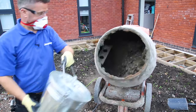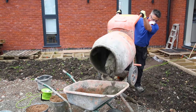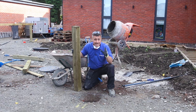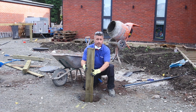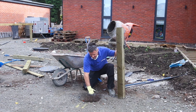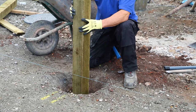Of course, if you haven't got an electric cement mixer you can always mix it by hand using a shovel. Now I've finally dug my hole out — it's about 16 inches deep so the post itself will be set right the way in. But I don't want to put it all the way to the bottom. Now I've mixed the concrete up, I'm going to apply some concrete in there, make a nice compact bed, and then set the post to the height that I want it.